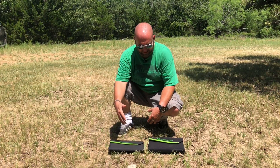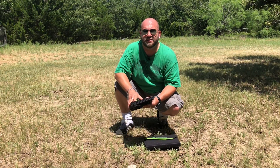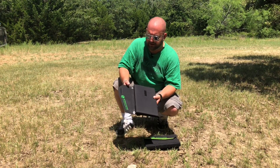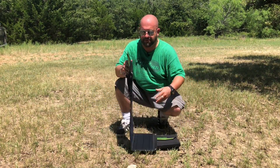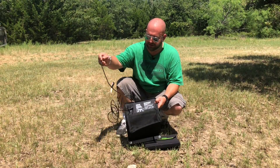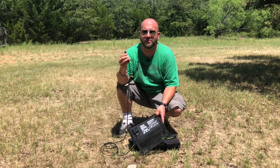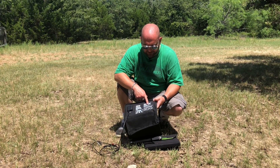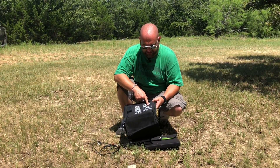I want to show you first the 28-watt and the 40-watt. These are really nice panels. I actually use these quite often for my G90 GoBox — they're really good at powering the 6-amp-hour battery in there. They've just got a little Velcro, and they unfold. There's a nice zipper pouch on the back that houses your charging cable connecting to your solar charge controller. This came with a barrel connector, but I cut it off and put power poles on. This is the 28-watt version — it's four 7-watt solar panels, with an output of about 15 to 18 volts and about 1.55 amps max.